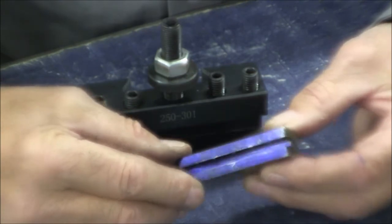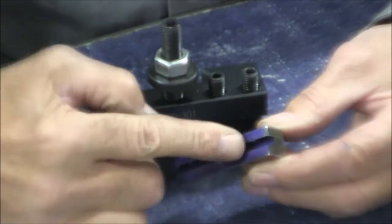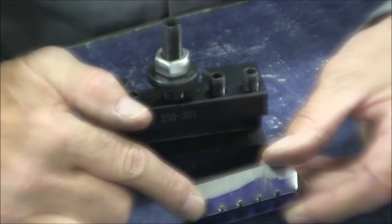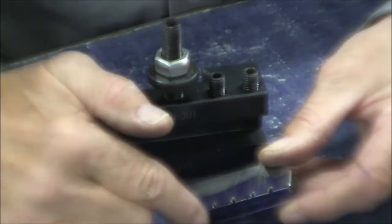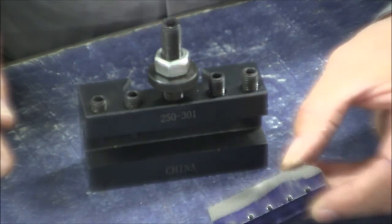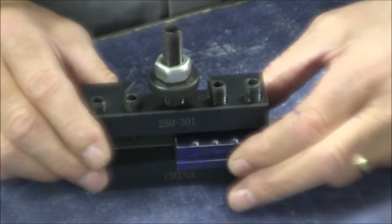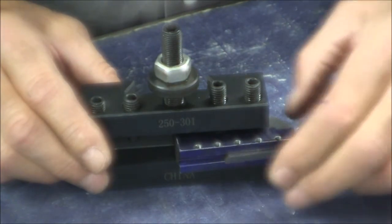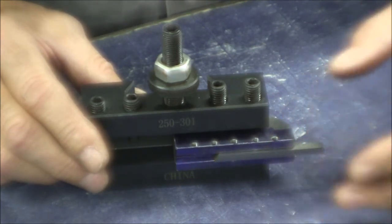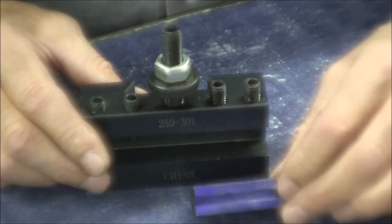So because I've got a pretty good taper on the sidewall of this slot, I'm going to go ahead and put it on the surface grinder, and I'll square that right up, and I'll handle that no problem. I've got the tapped holes in there, and they were a little dicey to tap, but you can generally get by with a little bit more when you're tapping and drilling than when you're milling small areas. So anyway, this is my threading insert holder that goes into my holder for my lathe. And so this is the way it's shaping up. I'll grind the thread cutting tip on this tool bit right here. So that's where we're at right now. We're going to go over to the grinder, and I'll set up to straighten that slot out.